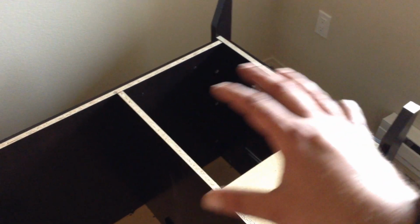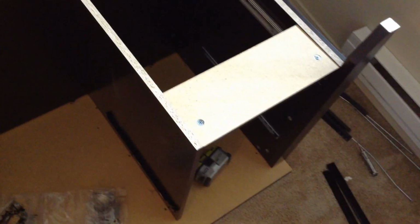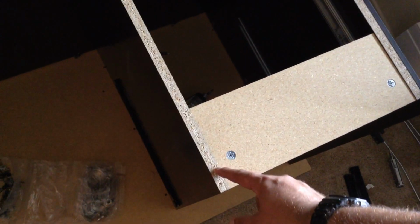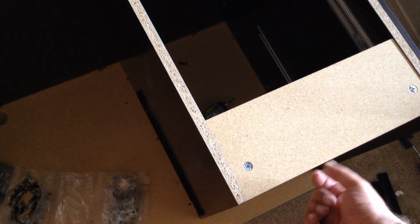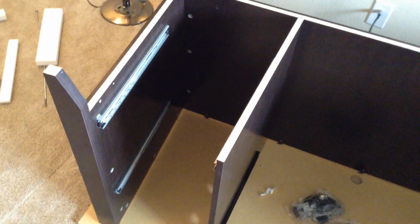You also want to do this stage of the assembly with this a little bit offset, so none of those pegs go into the holes yet, because you still want to be able to slightly flex some of this stuff back and forth in order to get these pieces in. They use dowels, interesting little metal dowels, so it's a little lock fastener at the front, a little dowel at the back. The finished part is what will face upward. Again, we're doing the assembly upside down.